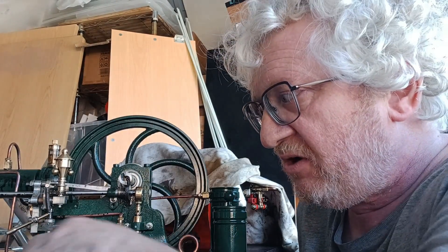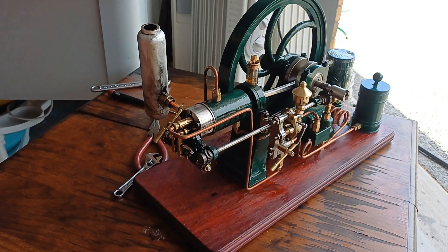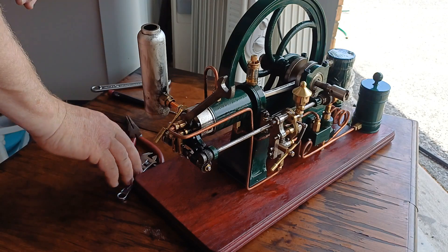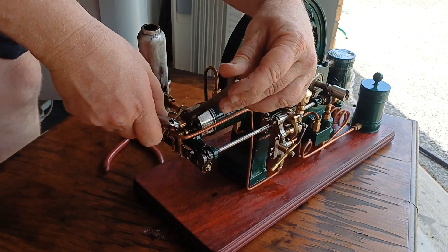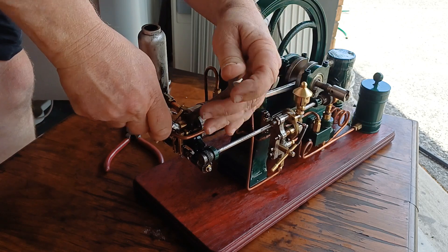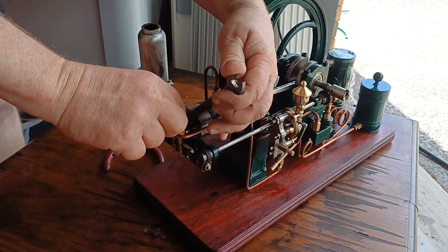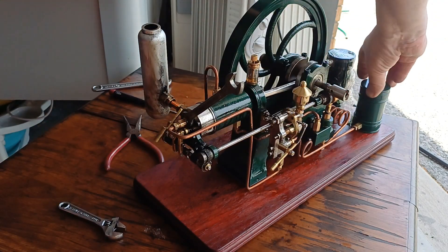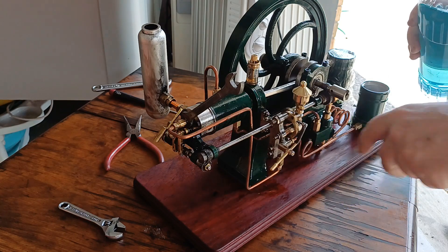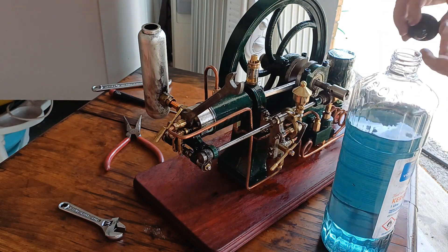I let it run out of fuel so I've got to do the bleeding again. Let's get an idea of the injector in this. I don't like taking this apart — it always leaks more when you've done it — but I think I've got grit in my injector or something. I'm filling this up now because I want the level to be as high as possible in the system when I open these things — I want as little air as possible in there.